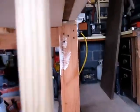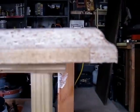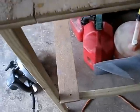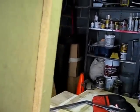Okay, turned up on end, this countertop is cut. That's a 36-inch piece. And you'll see end caps. See the wood that's added in here. That's also an end cap, and it serves as a build-up. And as you can see, the build-up allows for a flush 1.25 inches in this case, tops. And to see this from the flip side, this is what the counter would look like. That's a complete build-up. So now when your cabinet sits, it'll sit on those rails. Okay, and then what that does, that gives you a proper height.